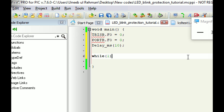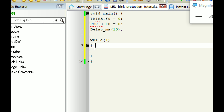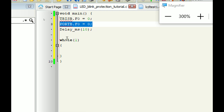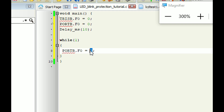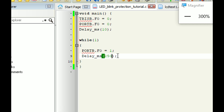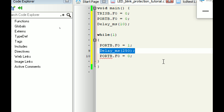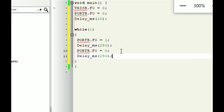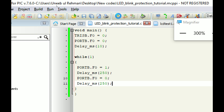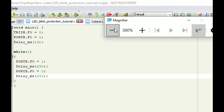I give a 10 millisecond initialization delay. I start the forever loop — inside it I write the code. First I change the state to one so the LED is on. I delay for 250 milliseconds while the LED is on. Then the LED goes back to the off state — zero — and it stays off for another 250 milliseconds. That is the simple blink code. I build it, then burn it to see if it works.